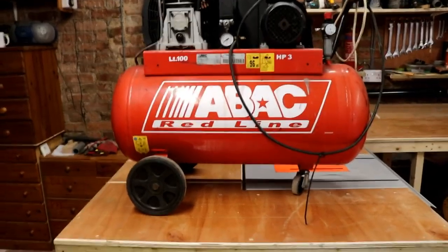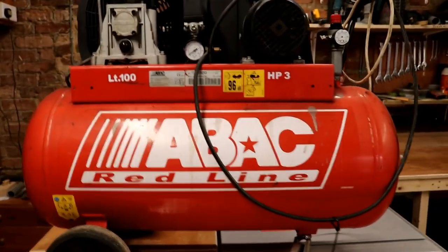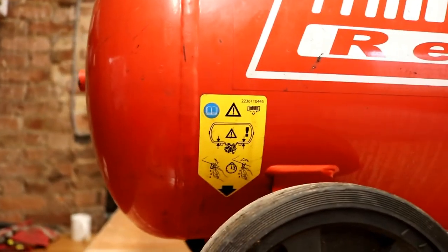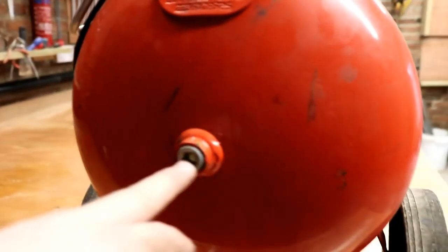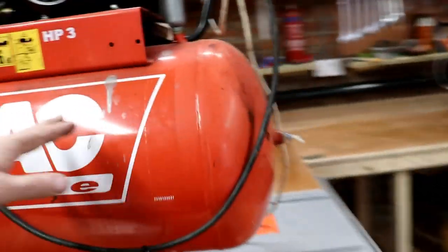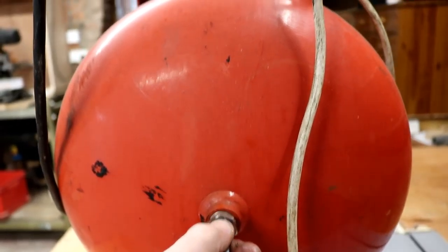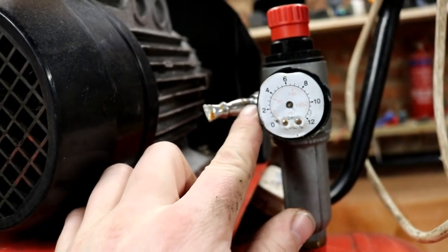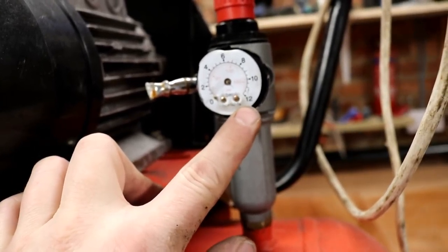Well, I really should have filmed that. So I've picked the compressor up, put it on here. This is a 2012 model. I'm slightly concerned that there's some water inside. There seems to be an indication of a blow-off valve. I also need to fabricobble some type of hex plug to go into this end to seal this up, because that is no good. And then we're going to change the connector for a female, I think, and we'll see if we can replace this dial. It doesn't need to go up to 12 bar, I'm pretty sure.